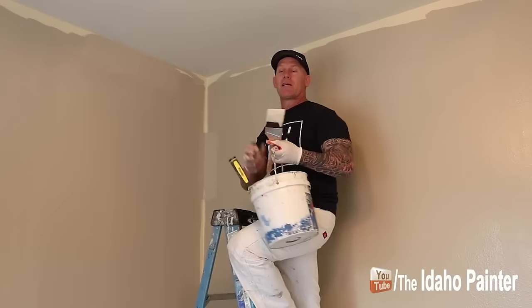We're not using the whole brush to cut in — just using the very tip of it. Part of the process of getting good ceiling cut-ins is having the proper equipment. Right now I'm using a three-inch angle sash Purdy Clear Cut brush, a stiff bristle brush because I'm using a really thick paint. A couple of things for really good cut-ins is holding your brush properly. I'm going to go over how to actually hold a brush when doing your cut-ins — a method that works for me and gives really, really good straight lines.